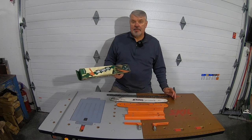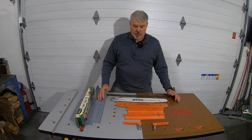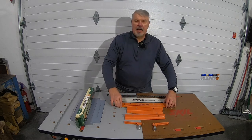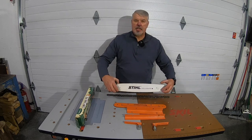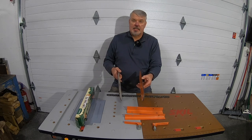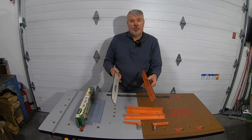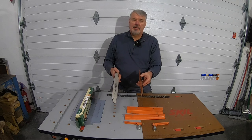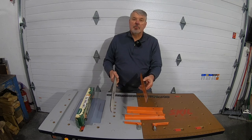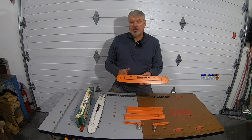When I purchased the Forrester chainsaw vise, it came in a box like this, totally disassembled. But there are only a few pieces: two pieces of angle iron, two cam locks, and a bar — very similar to your chainsaw bar. The groove on the Forrester bar will accommodate multiple different gauge sizes, such as 43, 50, 58, and 63. I don't think it'll do a 404 because I don't think that's wide enough. The drive link just fits inside here and it's tightened up with the cam screws. One additional thing to mention is this bar is 17 and a half inches long.